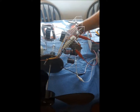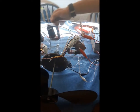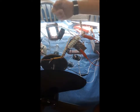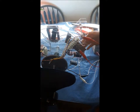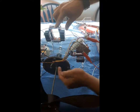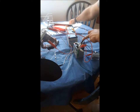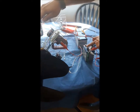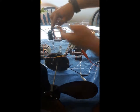That switches the power through these coils, which are all connected in parallel. These coils are from microwave oven transformer secondaries — I just took them out and attached them onto here. So every time the reed switch closes, the energy stored in the capacitor, which is powered by the solar cell, is dumped through these coils, producing the magnetic field.